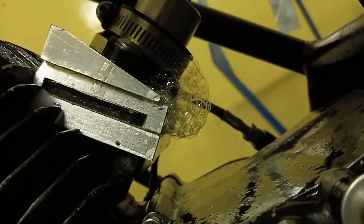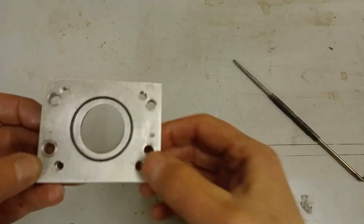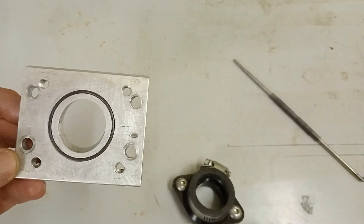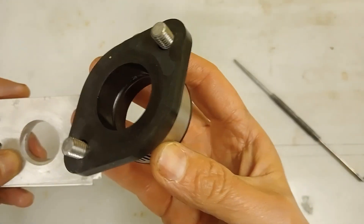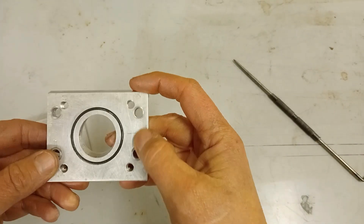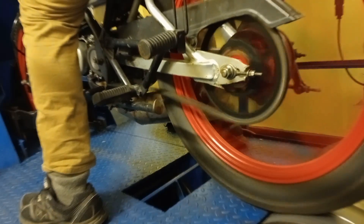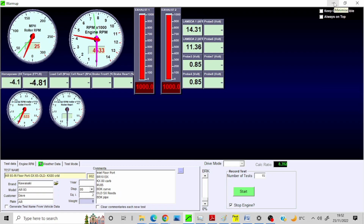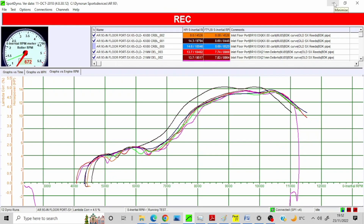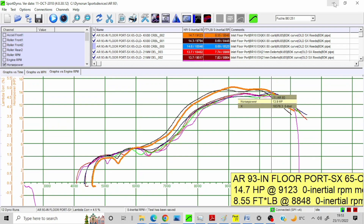Alright, try again. Okay, problem solved — I've figured it out. I stoned that off before, this little ridge, and it's come back worse. What is that? So this sits on top of here. I don't know if you can see through there where the screw for this goes — it's catching on there. It's digging into the alloy and it's going to be pushing it up, which is going to be effectively, as I'm screwing it in, distorting the seal.